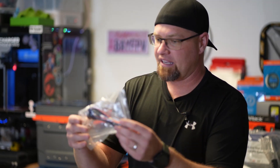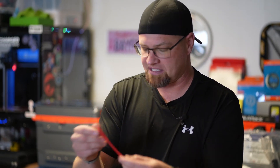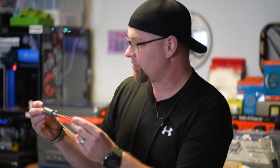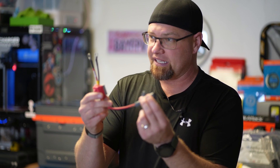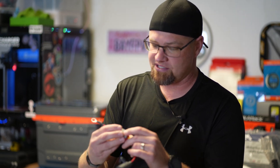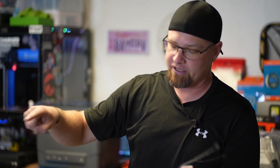There are a few loose guides, and we've got the Yak Power accessory — looks like an extension cable. We have another little extension. Right here is what's going to connect in the front of the boat where the trolling motor goes — you connect this to your trolling motor negative and positive for power. This piece connects in the hull and has a 50-amp inline fuse, going from your battery all the way up front to power the trolling motor.